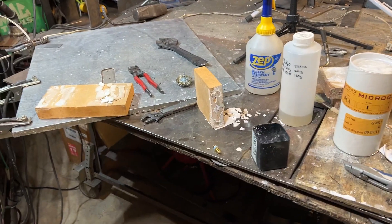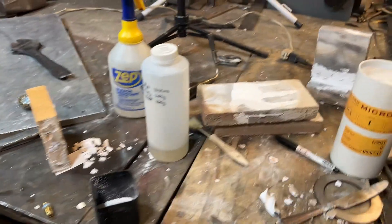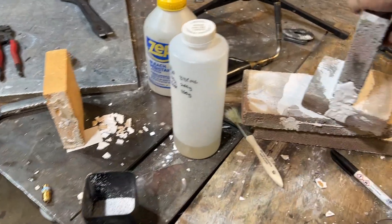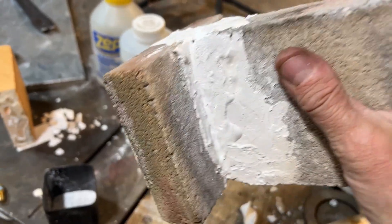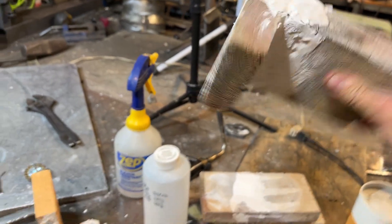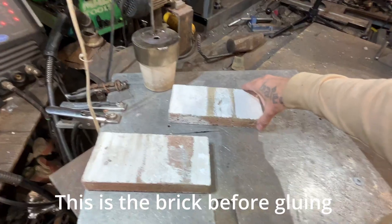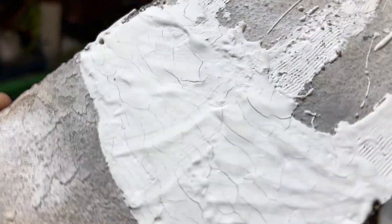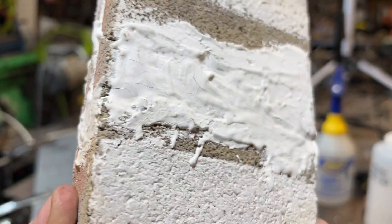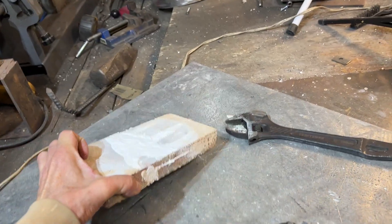What's up fellas? Doing some preliminary testing here on a new composition. I also wanted to bring to the table some of the other tests that we were doing with the new refractory glue. These are the bricks that you guys saw me break with my hands, and I glued them back together. This one here was in three pieces. This has been fired to about 500 degrees. We got some significant crazing there, but even with the crazing the stuff is so strong — you have to break the brick to take it apart.